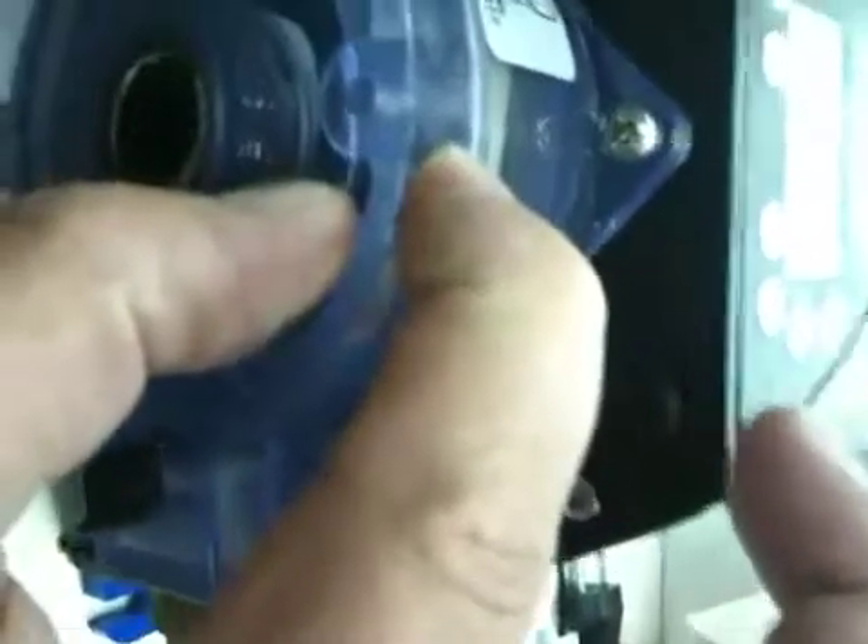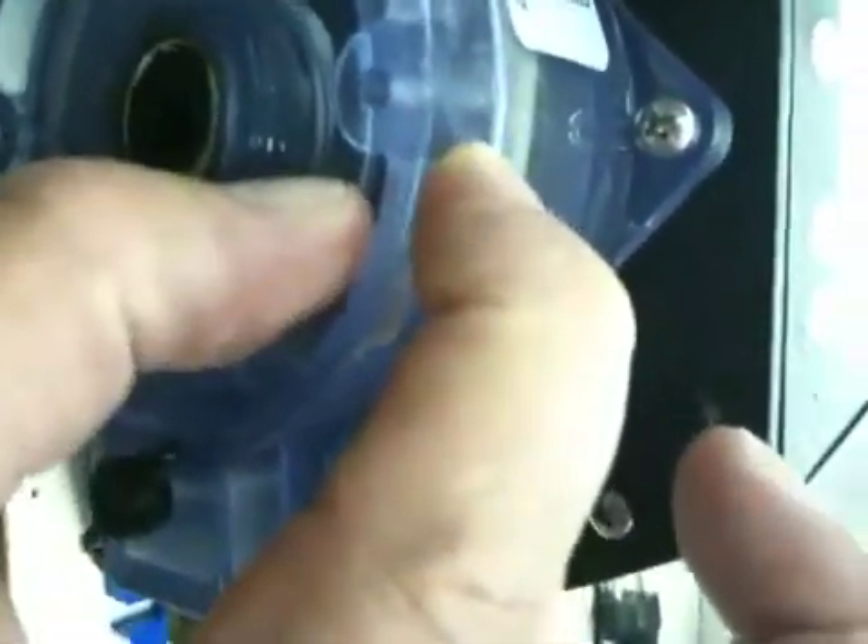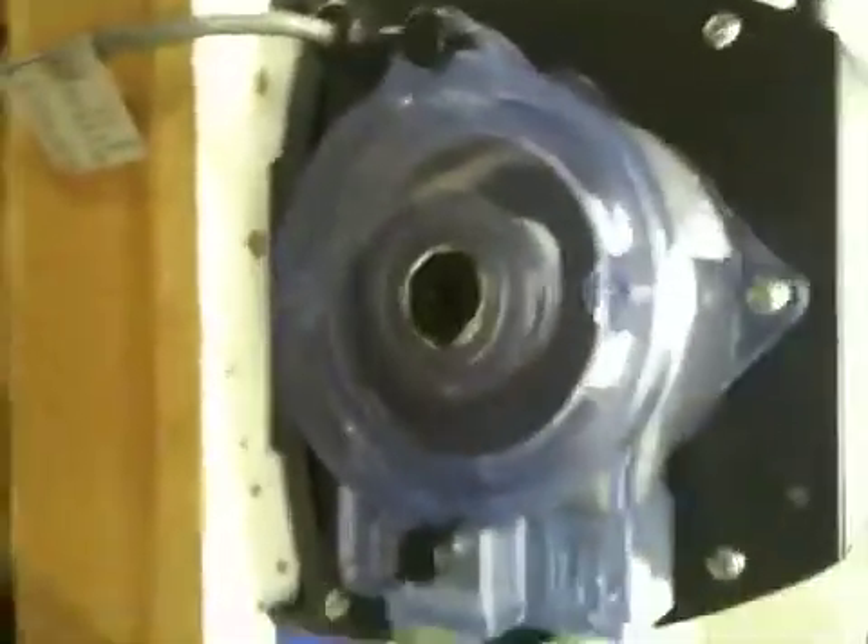Here's the front of the pump with a heavy duty pump head. You'll notice that this pump head is extremely thick — the material is a little bit over an eighth inch thick, very heavy duty. The shaft and rotor assembly is very large, with almost a three quarter inch shaft. So, very heavy duty pump head.